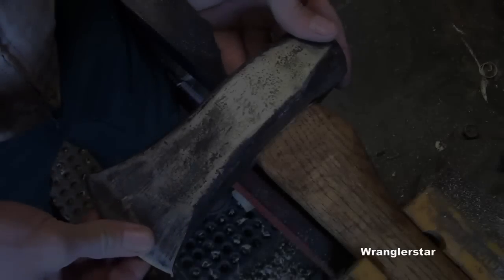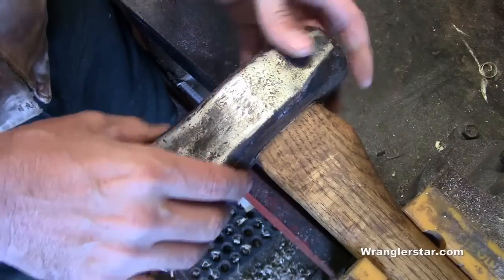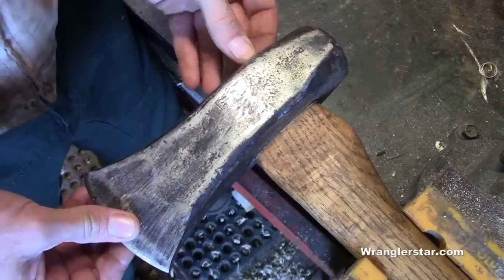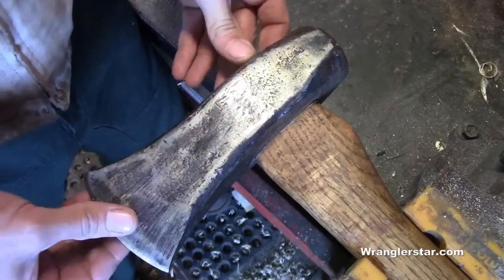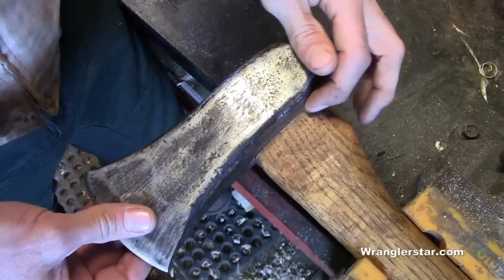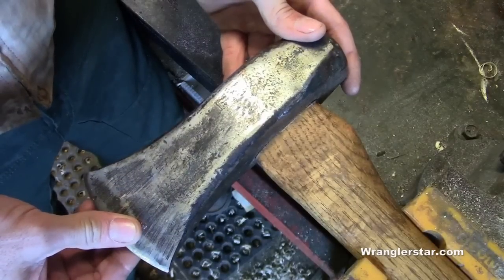Even the best handle hanging jobs can go bad. If the wood moisture content is too high — above 10% — you can expect this to happen. These handles can be produced in high humidity areas and you may be using them in drier areas, so this is just inevitable. But there's no reason to throw this handle away and start over when we can usually get this fixed without too much trouble. So let's dig into it.